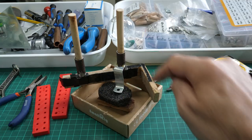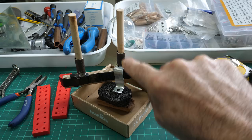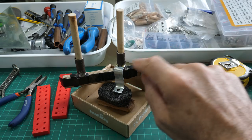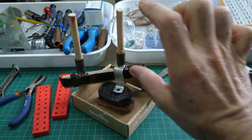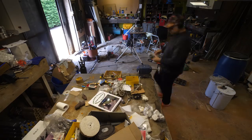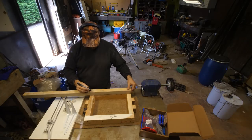Let me cut in, the audio is getting really bad. Theoretically, as long as the 2 rods are parallel with each other and vertical, but it's more important that they're parallel to each other, the frame could be any old shape as long as it's stiff. Let's build it. Using some scrap wood, I start off with the base.